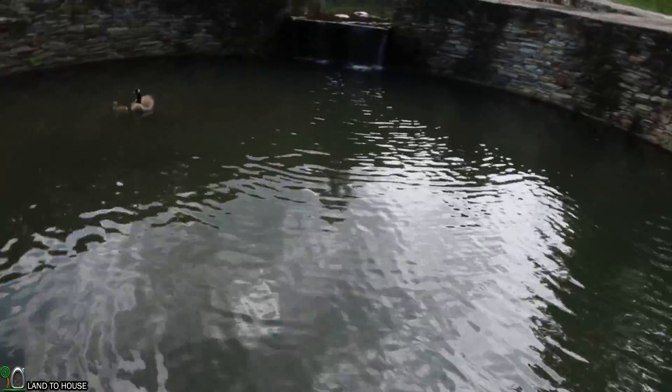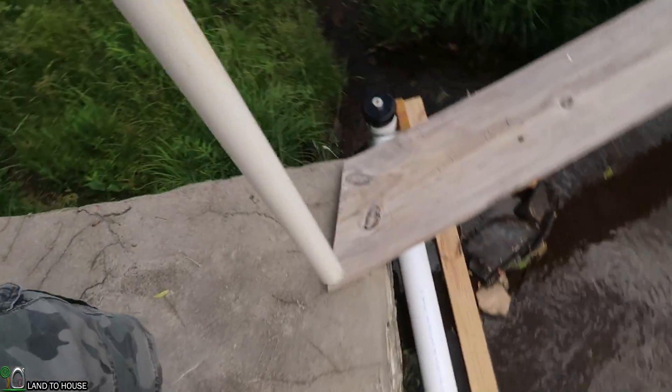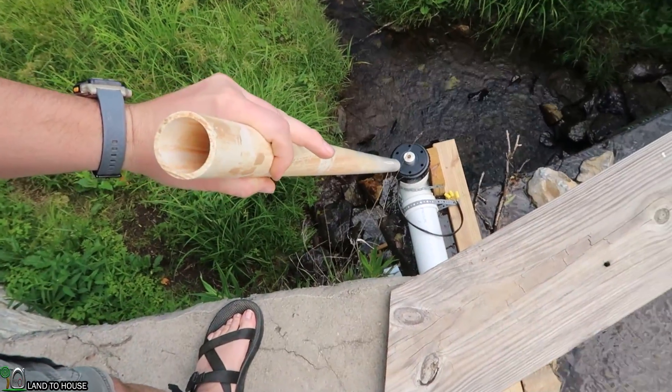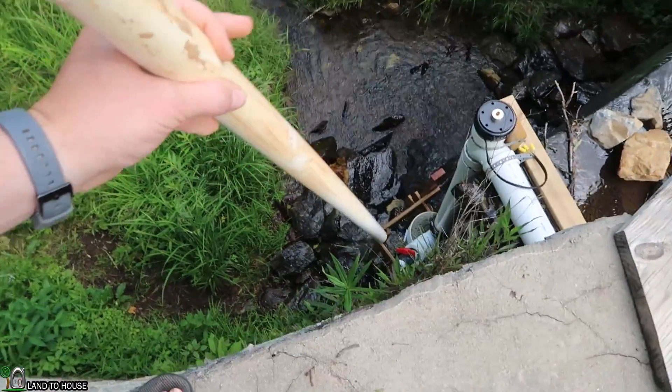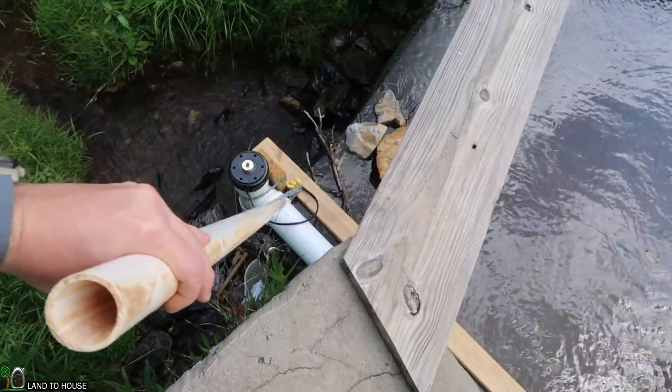Welcome to Land the House. I'm Seth. I'm working with Langston's Alternative Power to test out a four-inch micro hydro unit. Water is siphoned up into this four-inch pipe, comes along here, makes this four-inch turbine spin. The water drops down into this bucket and the bucket is what helps maintain the siphon. We've got three phase right here coming out. In the previous test, the power was about 18 watts. We're hoping for more, so I have to do a couple of things to try and get more power.